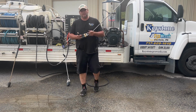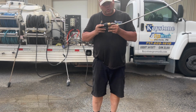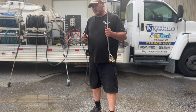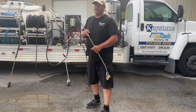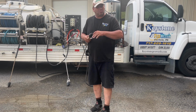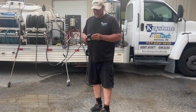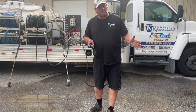And also, just to let you know, if you have a 10 gallon a minute machine, get one that's equivalent to 12 gallons. If you're 8 gallon, get a 10 gallon. It's not so much the pressure, it's more the volume disrupts. And I've had one that I matched to the machine, and I had to lower the idle down just because it's so violent. We don't want to tear things apart. I use this on brick, paver stone, stone walls, everything. And sometimes you want to turn the idle down, and then allow the heat to come up. And that's when I do also my curbing to get off all my tire marks.